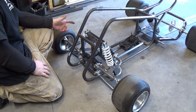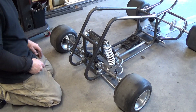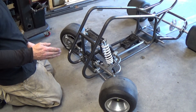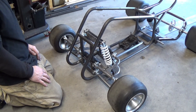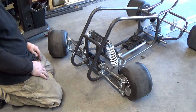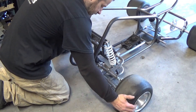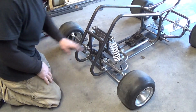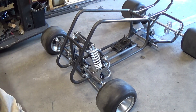I have the swing arm assembled on the ground. I wanted to get an idea of what it looks like, but it's not going to work this way. I'm going to redo the spindle arm coming off — it's not working how it is. I get a good angle from one side because of some offset, which makes it where it's not going to work right. So I need to redo the mounts on the spindles for the tie rod so I can get zero Ackerman and have even wheel lock on each side. This isn't going to work like this, so I'm going to pull those back off and cut some tabs to mount the tie rods to. But it's getting there — it's always going to take some trial and error when you don't know where you're going.